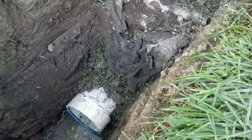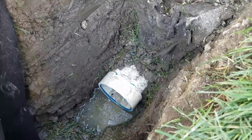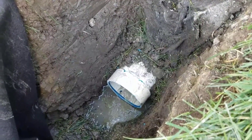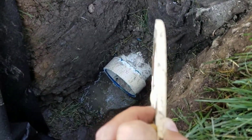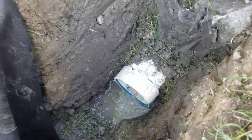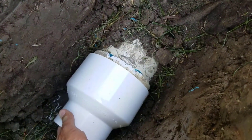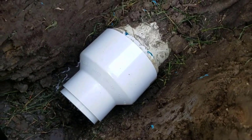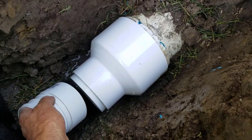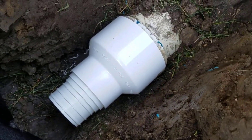When catch basins are sleeved, they're a funny size. What works well for us: we cut off the end cap — just the very end — and leave that collar. If you leave that collar, you can then take a six-inch to four-inch schedule 40, and it fits on really nicely. They make a bushing that slides into that, and then your adapter to take you to your corrugated perforated pipe slips right into that bushing.